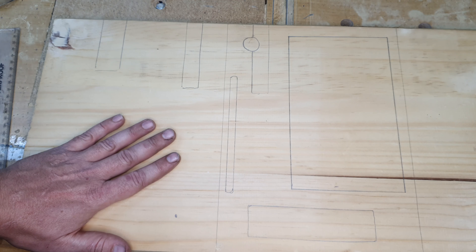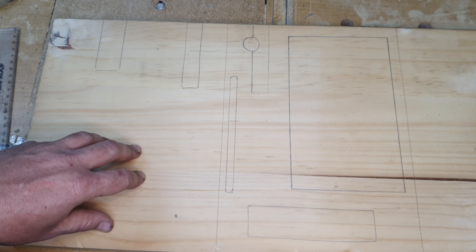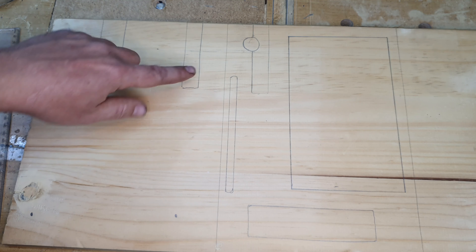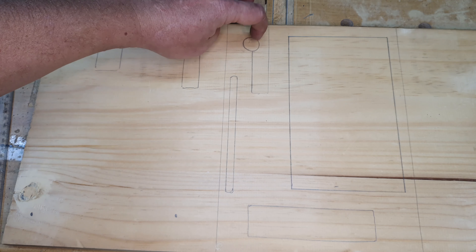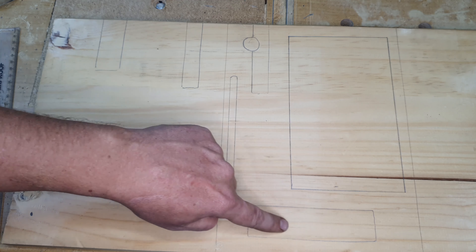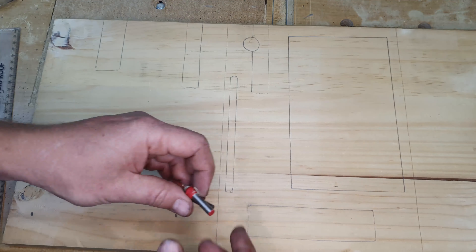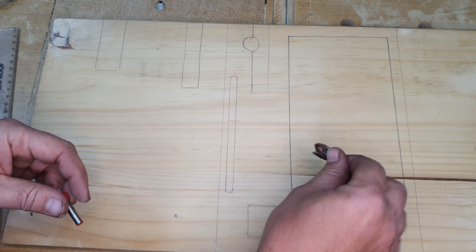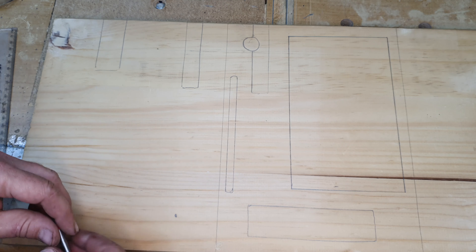The rest is up to you — how you want to design it and what you want it to do. I drew my design here: this is the bottom part, this is the upright part, and those are the two grooves I'm going to cut out. I'm also going to cut a big circle hole all the way through for the charging cable for my cell phone. This part and the bottom part will be cut out completely, and this big rectangle here will not be cut all the way through — I'll only hollow it out using a router bit to about half the thickness of the wood. This little groove here is also not going through; it will only be about five millimeters deep, made with the router bit.